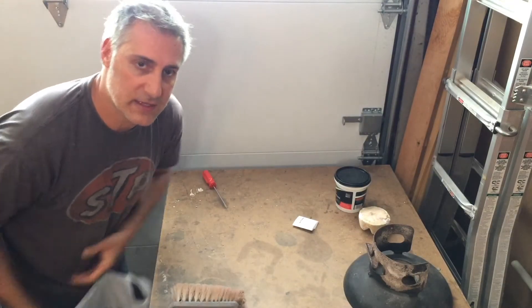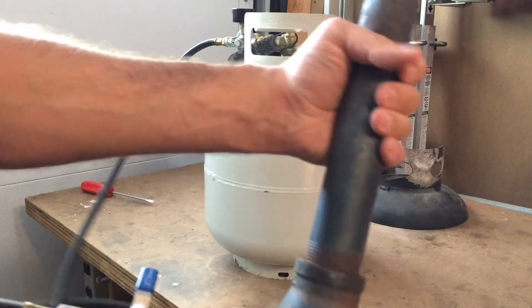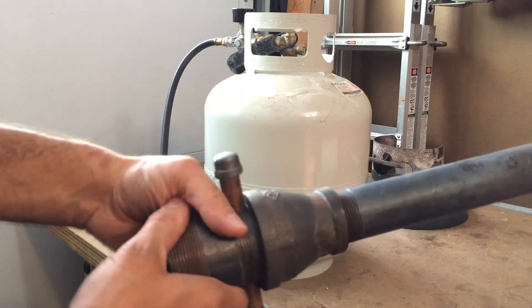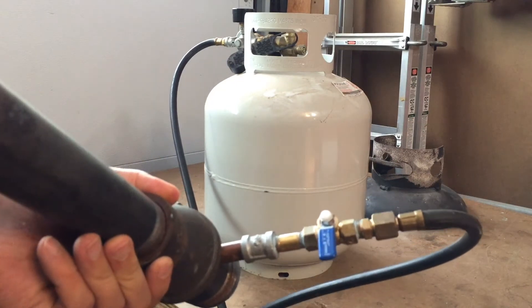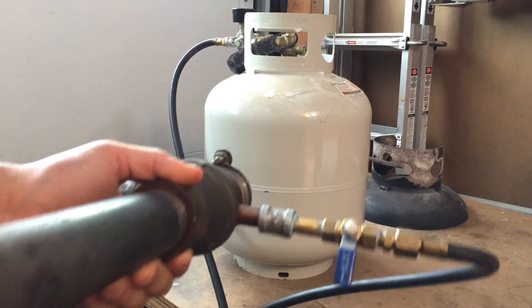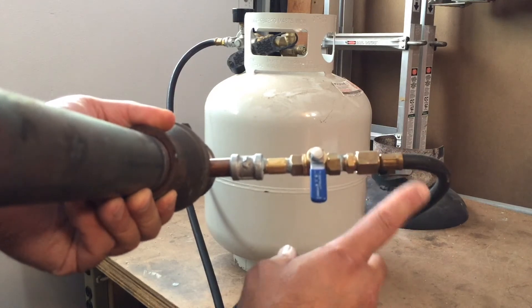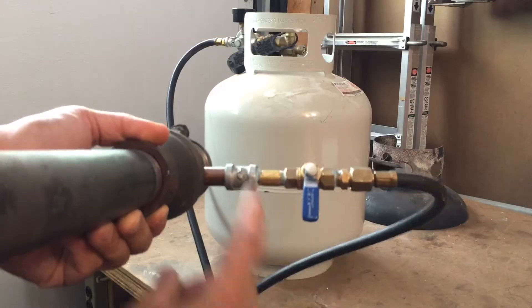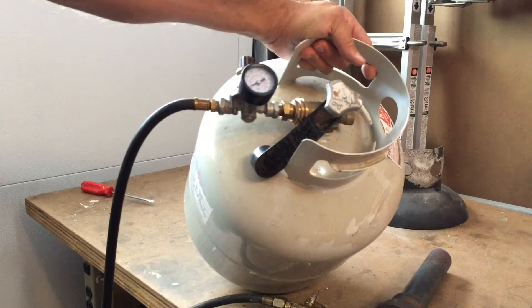I want to show you one other thing I did to the foundry — it's really something I should have done right from the start and I'm glad I did it. It was pretty easy. So this is my burner that I put together, and one thing I never had on this was a shutoff valve, which I have right here. Seems kind of silly that it was never really put on. I had to buy a shutoff valve and a quarter-inch nipple to connect it. Before, it was just connected directly from this line to a little adapter that went right into this coupling. I did test this out and it worked. I know — kind of dumb not having a shutoff valve. You live and learn. Luckily I didn't blow anything up.